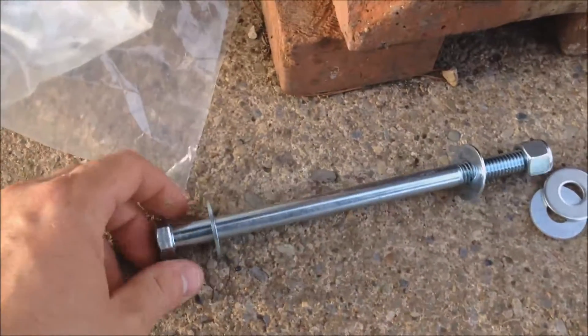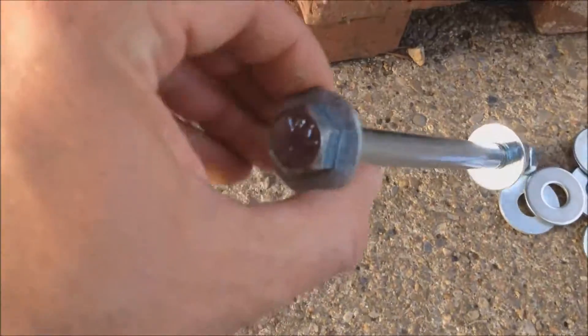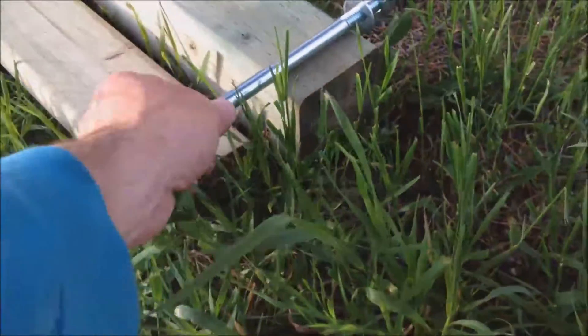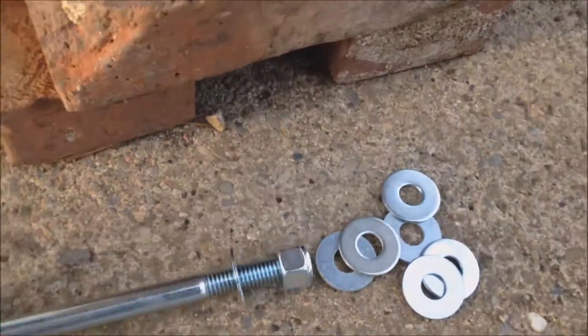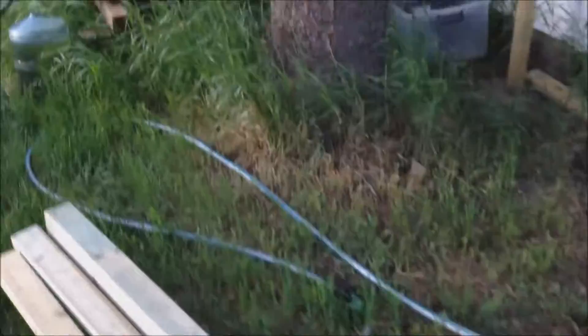What we're talking about is an eight-inch by half-inch bolt. We've got washers on each end. And because a four-by-four is actually only three and a half inches, you're technically seven inches with a pair, so eight inches should be plenty. And a locking nut on the end because they didn't have any regular nuts. We've got four of those because we've got four support legs.